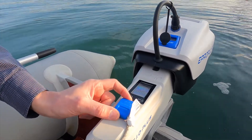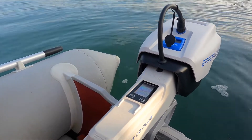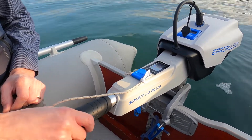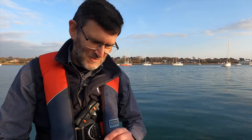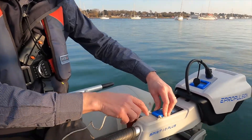The kill cord on here is just a magnetic tag that sits on the tiller — it just lifts off like that, so the motor is not operable. Put the magnetic tag back on and you can run the motor. There's probably some thought needed here for a training situation, because this falls off rather readily. If I turn around and catch it on my knee, it just falls off and the motor stops. There are a few design tweaks needed for the context you'd be using it in.